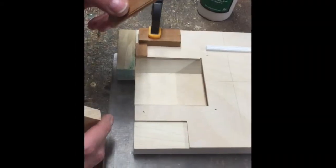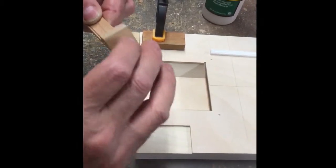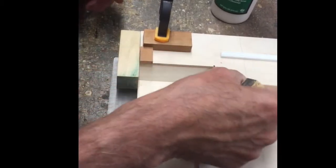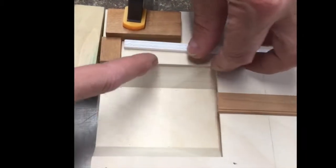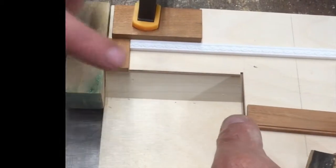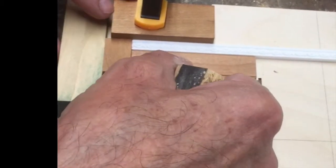Gluing in the vertical marble piece, you lightly relieve the top edge, which gives the impression of a nice smooth seam with the adjoining horizontal piece. Now the location of this piece is determined by this block. We're going to use some of the egg and dart cast molding as a spacer, which is technically the next piece in line, and then this marble piece will butt up against it.